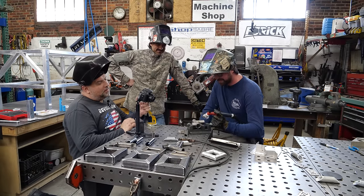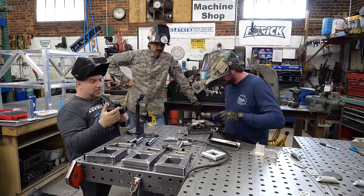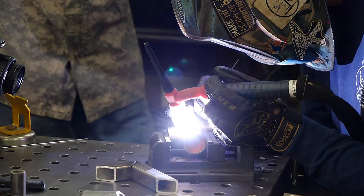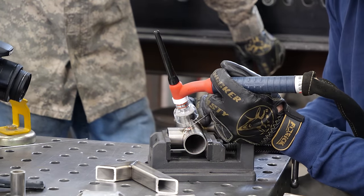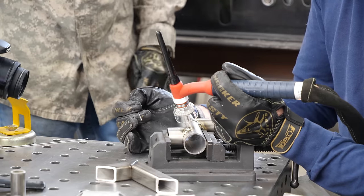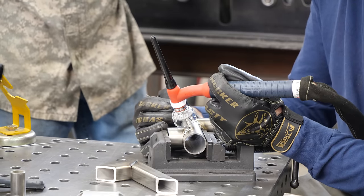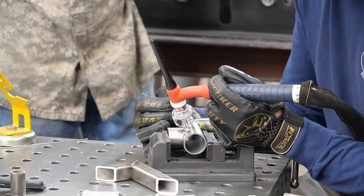What I would do is start somewhere here and weld uphill. I'm going to get a good run. It's funny because I'm right-handed but I taught myself to weld left-handed. My biggest issue is wire feed with my left hand. I was deciding: I'm gonna give my right hand the hardest job. Can you explain again why it's important to keep the filler rod in the envelope? Because it turns black, just like the tungsten if you don't have enough post flow — titanium is not supposed to turn black, so you keep it in the shielding envelope.